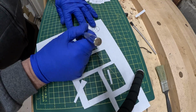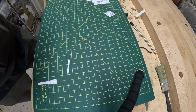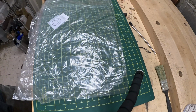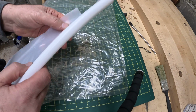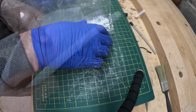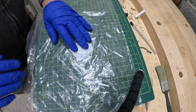So this is what I did. I glued the Teflon to the paper pattern, and that would give me a period of time when it was sort of clingy or tacky that would let me punch out the gaskets. Here's the Teflon, fairly basic, 0.1 millimeters or about 4 thou thick. It comes in a nice little roll and was $15 or something from Amazon.